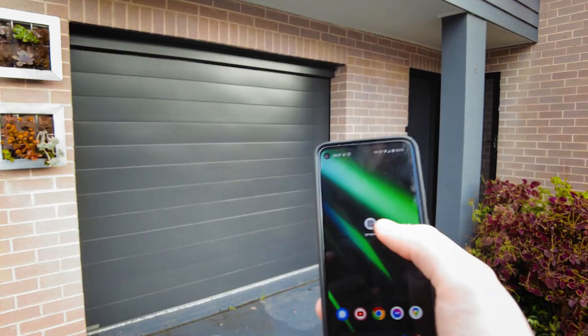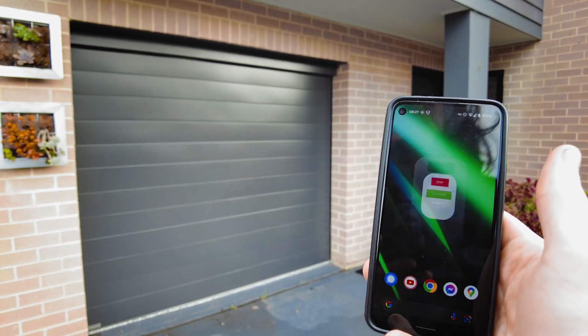I'm so pleased with how this project feels — it feels completely instant when I touch that button on my phone. It's actually more responsive than my real physical garage door remotes which often have a gummy unresponsive button. That's a perfectly functional garage door controller you can access from your phone. A nice extra would be to assign a static IP address to the Pico W so its address doesn't change. Since I run a Pi-hole, which is a Raspberry Pi-based DNS server, I redirect all traffic for the domain garage.door to the Pico's IP address, so I can just go to garage.door and save it as a bookmark.